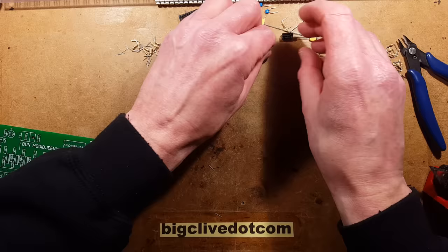The next thing is an electronic fuse. This one is purely for the control circuitry — it's just an easy way of adding an on-board fuse. This is a polyswitching type fuse, a positive temperature coefficient thermistor, and it behaves like a slow-blow fuse. If a fault occurs it gets hot because it has a starting resistance, and as the resistance gets higher it dissipates more power and gets hotter — basically an avalanche effect until it locks into a particular current and resistance that keeps it at that trip temperature. When you turn the circuit off and the fault's gone, when you turn it back on it will self-reset once it cools. It's just a nicer approach than a traditional fuse.